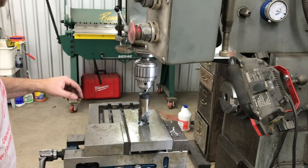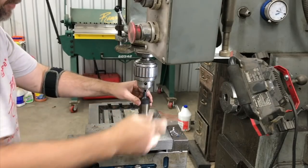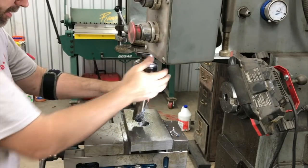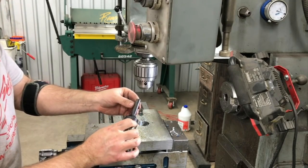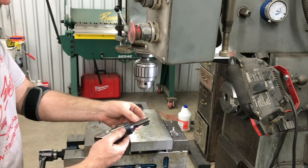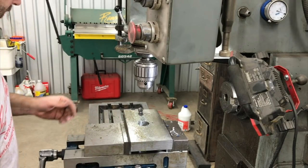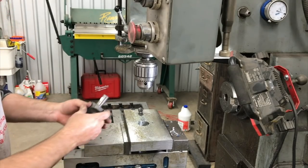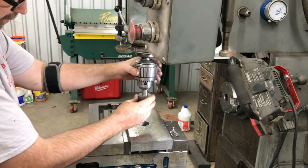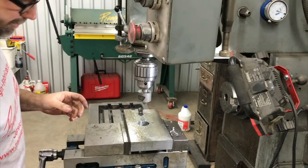Gonna try to chamfer this hole a little bit, and it's a 1.5 inch hole, and I've got a 1.5 inch countersink bit here. And this shank has got some flats on it, which really kept it from twisting. The tool's not that hot. You see none of our chips have got dark colors or anything, so I think we were running it pretty safely there.